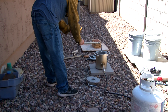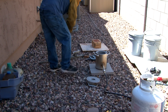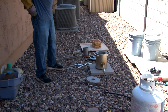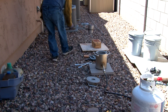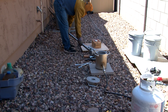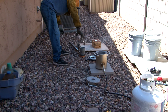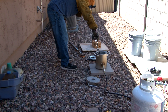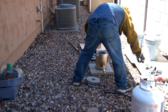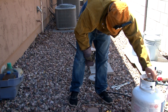I picked up a thermocouple and temperature reader off Amazon — the whole setup was probably just about 50-60 bucks. I try to run between 1300°F and 1400°F for my pouring temperature. I've poured hotter and it seems to make a weird surface on the part, so I try to keep it in that range — around 1350°F at this point. The only reason I'd pour hotter would be for lost foam casting, where you'd need more energy in the aluminum since it loses temperature while burning off the foam. For straight sand casting, keeping it around 1300-1400°F works pretty well.